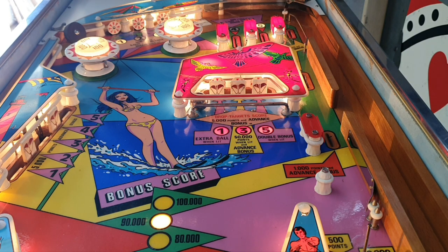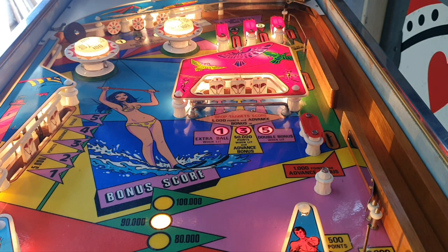The other interesting thing this game does — which we've not really seen before — is on a match, you can only get a match on odd numbers: 100, 300, 500, 700, and 900. Those are the only numbers on the back glass. However, the step unit, which is like an AFS relay, is still a 10-step unit, so it's possible you won't get a match number a lot because it doesn't make a circuit to go there. Something a bit unique we've never seen before. That's Icarus, and we'll close off this video — this has been another Goat Shed presentation.